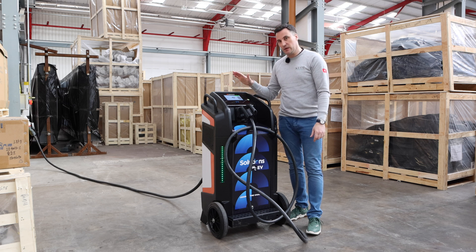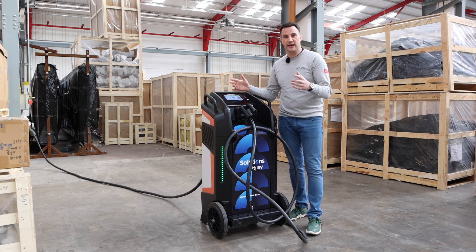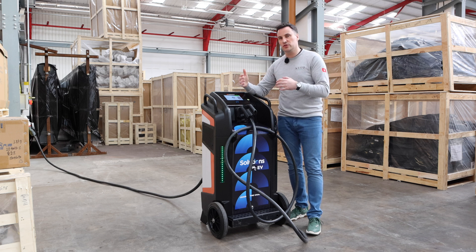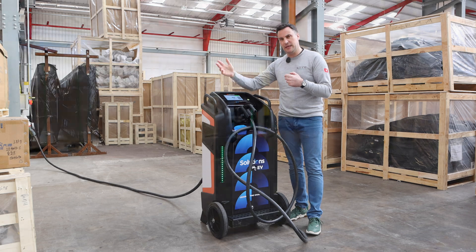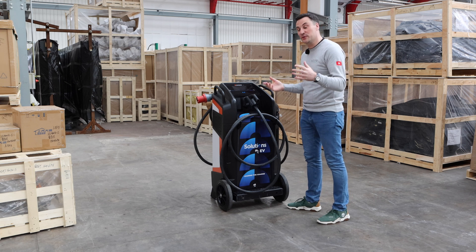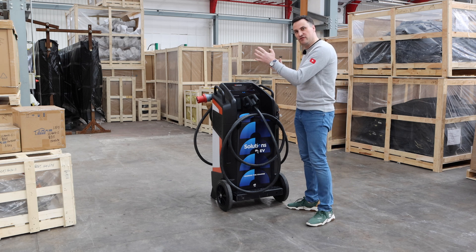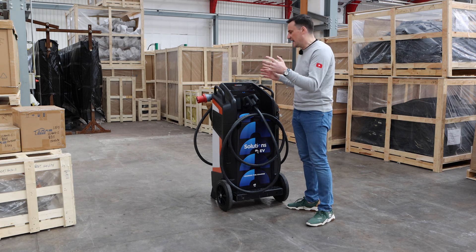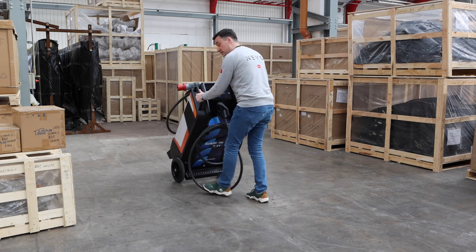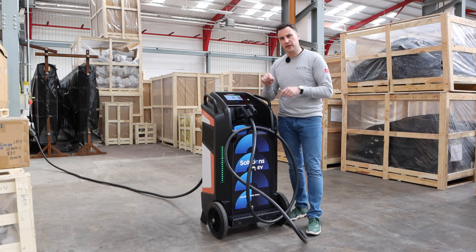That is the Kempower T-Series. The perfect environment for it is where you may not need — or don't want — a grid connection upgrade, but you want to introduce an electric fleet, whether that's cars, vans, or buses. With the wheels on the side it is portable to an extent, so you can place sockets around the building and premises rather than having a fixed DC charger that can never be moved. Just make sure it's unplugged before tipping it back — it is 120 kg, so it's not light, but it is movable.